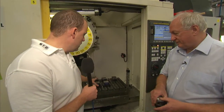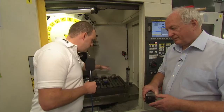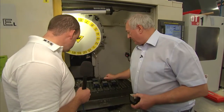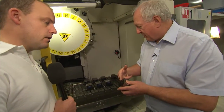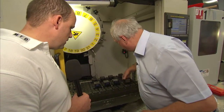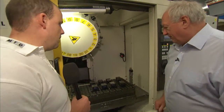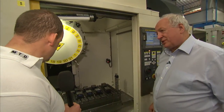Even if you were looking at doing larger plates, you could move the vices and locators back to hold a larger plate too. For plate work, there are stops you can put onto the vices to position the end of your work. You can also set them up in a double vice configuration back to back, doing two parts, really populating the plate with as many vices as you can get on.